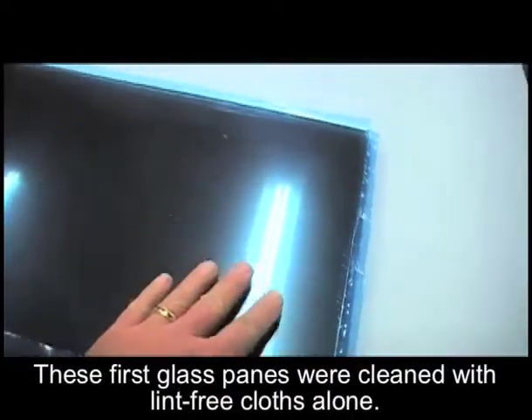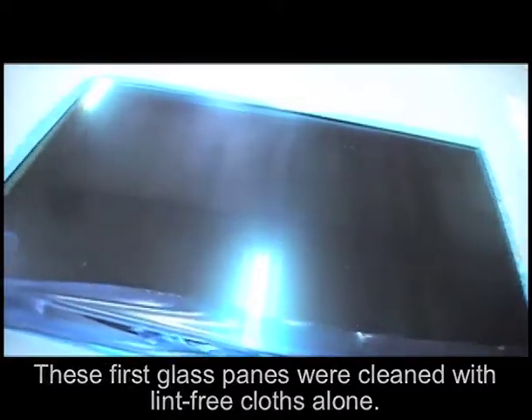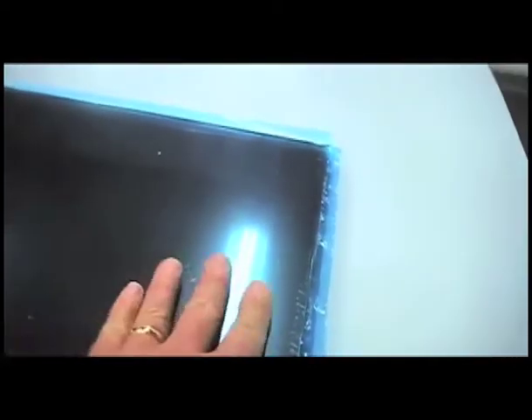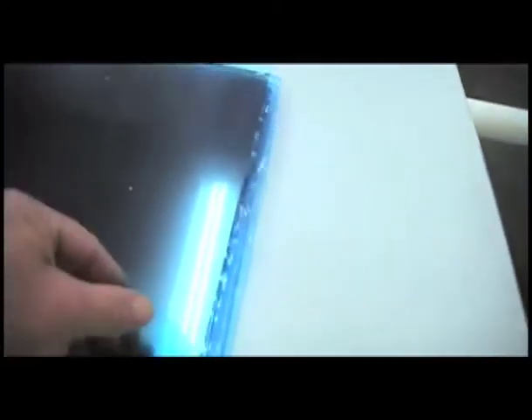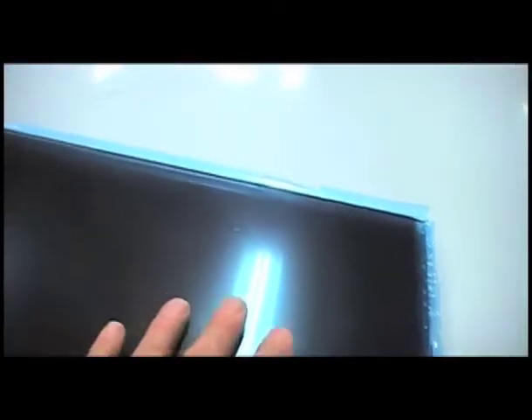What we're seeing here — you'll probably see it in the camera — you've got little air bubbles, this type of thing. The nip pressure is fairly light right now, so the laminate will peel off fairly easily. The dust that we're getting even after wiping underneath, you can feel the bumps on it. We've got them all numbered here, one through five so far, so you'll see the first test results.